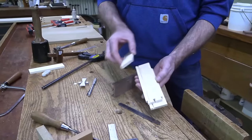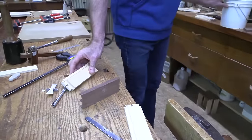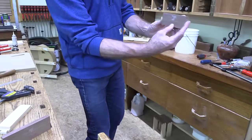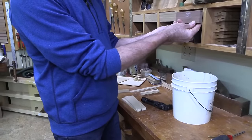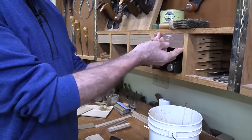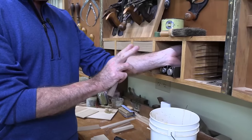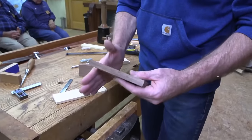Once you've got that sawed, you can rip your back piece to length. When sizing these pieces, I had to cut them to length too. I cross-cut these on the table saw so they would just press-fit in — see how that's just gently snug. I cross-cut the back at the same time so I have a parallel channel in there. The sides I'm cutting to length so they don't quite hit the back — I'm going to use a different kind of stop. That press fit will clean up once you hand plane after it's assembled, and it'll fit beautifully.